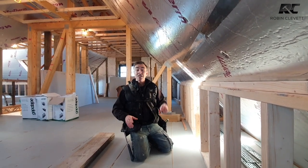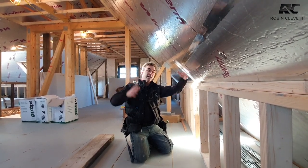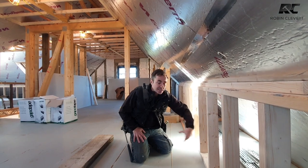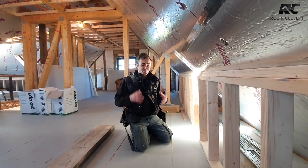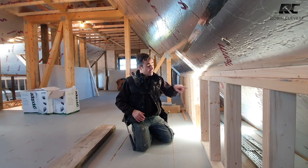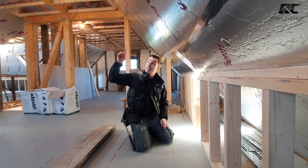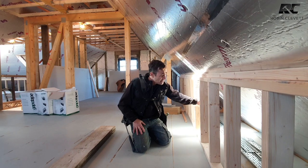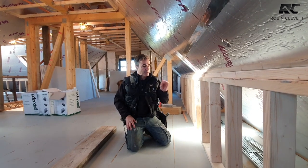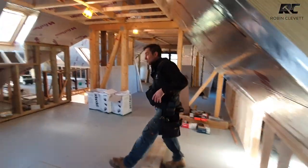Sometimes PIR starts between the rafters up to the ceiling, then PIR goes in the stud wall, and sometimes normal rock wool insulation goes in that bit of floor. What you get is a mixture of different installations that all behave slightly differently. What I prefer is a continuous insulation module from wall plate to ridge so the whole envelope is perfect. We can run services inside — it's the warm side — we can run cables, put downlighters anywhere we want in the ceiling.